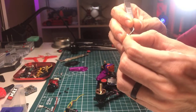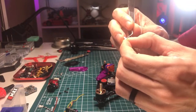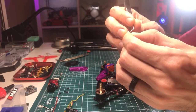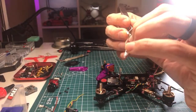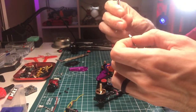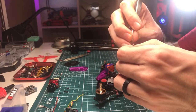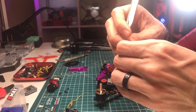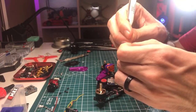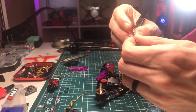And that's why Hobby Wing did that, because you had to plug this 6er and like a 4 into their flight controller, because this 6-pin had VBAT and motor signal, and then they had a separate 4-pin with current and 5-volt for some reason. And it didn't even have telemetry. It wasn't even a 32-bit ESC. But yeah, that's why I'm trying to save this connector and not wreck these little flaps, because this might come in handy someday. Although, I could just take a pair of dykes and cut the side flaps off of another one of these, but that's not my style.